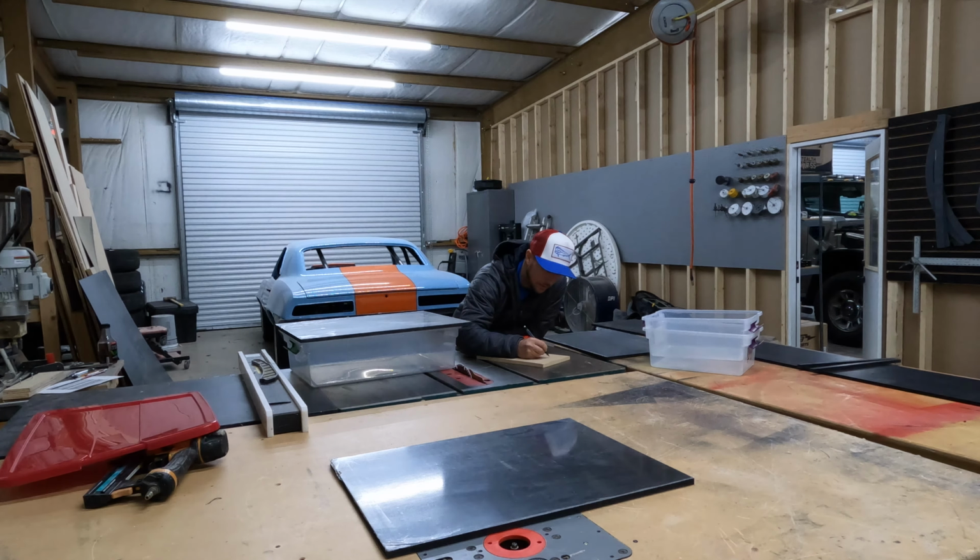And I'll pull the camera off of this tripod here in just a second and show you some close-ups of everything I'm doing. But all I'm doing is just popping these shelves in here, making sure they're lined up perfectly, and shooting the screws through. I'm using a sheetrock style thread. It doesn't have the super coarse threads, but it's what we use here. And then I bought some actually short screws, which I'll show you, to put the back on.